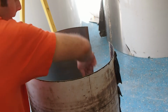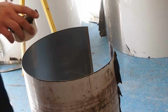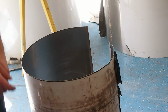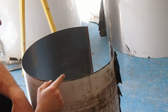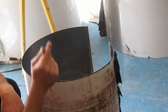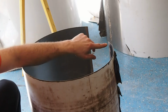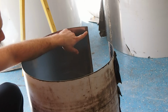And I found that to help also get backside penetration. Now, I applied the flux and you think, all right, he might be done, but I've found that after you fix it up and you tack it, you got to allow the thing to roll a little bit and paint flux on the back of it again, because you basically use up the flux wherever you tack at the little spots, and then when you try to weld through it, it gets brittle and you don't get good penetration and it looks like garbage.